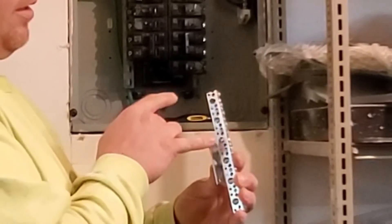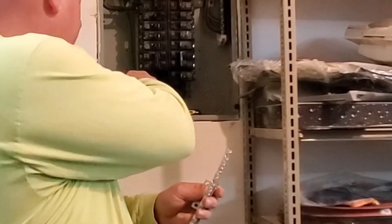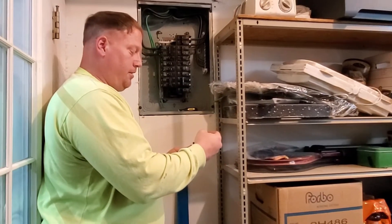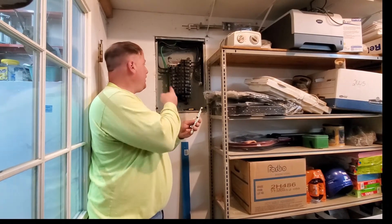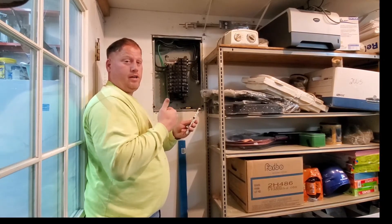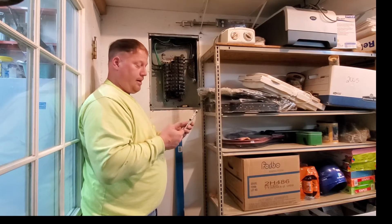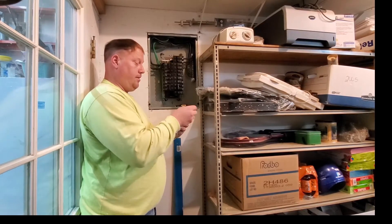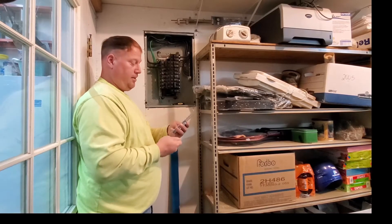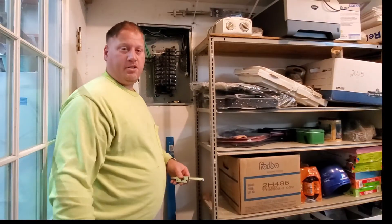These holes are technically big enough for 1-aught wire. Well, my problem was the hold-downs that hold this bar to the panel were right there, so I only had one lug and I've got two big ground wires I need to ground — not including any future wires. I plan to run a plasma cutter, I have a welder out here, and if I want to run a dedicated compressor later I was out of spots for bigger wire. So I do have to modify it because there is no mounting hole for these screws. Let's go to the workbench and make it happen.